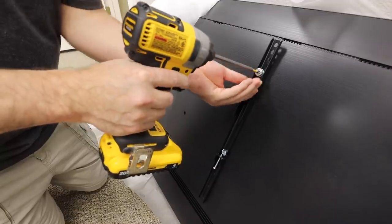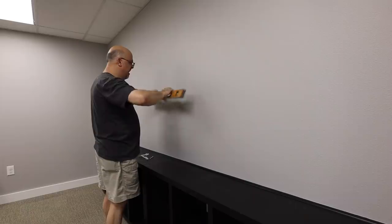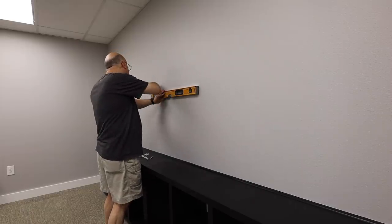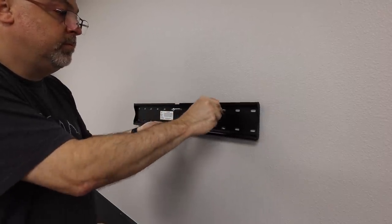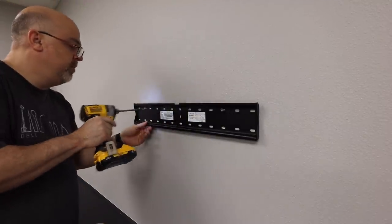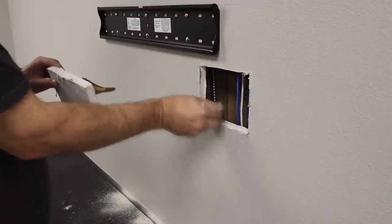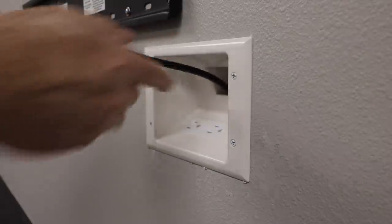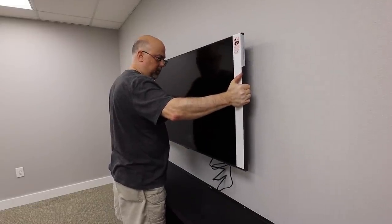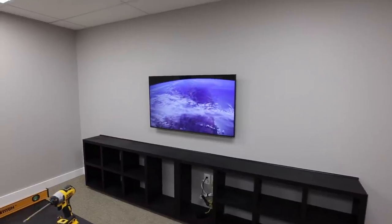Moving on, it's time to install the TV. I decided to go with a 50-inch and center it on the credenza, mounting it on the wall to make it look nice and clean. If you install the mount temporarily, you can use it to get your measurements for drilling the holes in the wall. Since I have aluminum studs on this wall, I used toggle bolt anchors to securely grab the studs. I wanted all the wires inside the wall, so I used my multi-tool to cut out a hole for a box that contains power and HDMI cables — this box just tilts into the wall and then screws clamp it in place. I then lifted the TV and hung it on the mount.